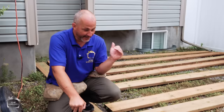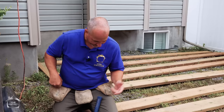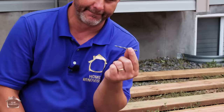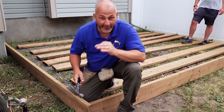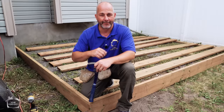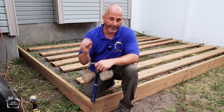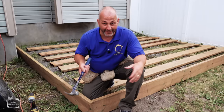When attaching your lumber, I've got a few different systems depending on your tools. The easiest is a pneumatic nailer, but you can go out and just buy yourself some 3-inch spikes and use a hammer and nail to put it all together. Because the truth is, if you have a hammer and a measuring tape, you can build a deck. We're using a 2x8x10-foot end board and 12-foot joists — and since every joist is the same length, we don't have to do any cuts out here. You don't even need a saw.